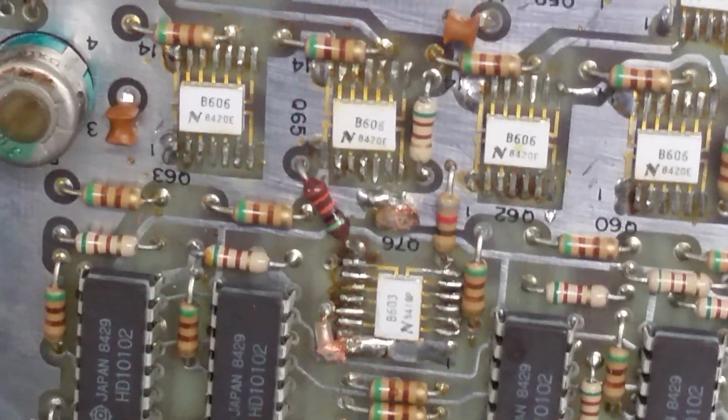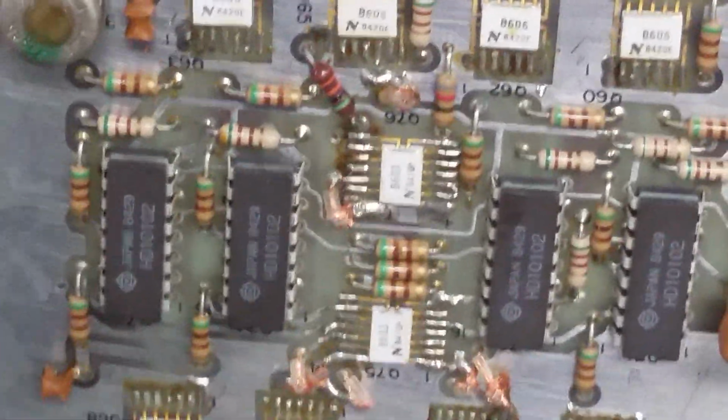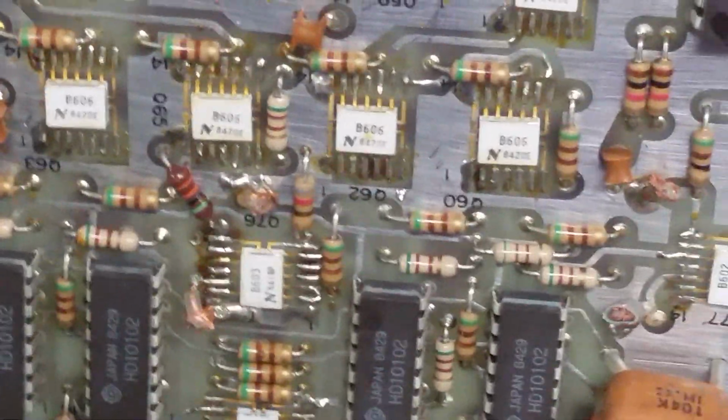They have the logo. They certainly kind of have the ECL vibe, being near some other ECL, and there's an awful lot of termination resistors kicking around, which also kind of screams ECL, because with ECL you have to treat everything like a transmission line. Everything gets a termination resistor. That's just the way you had to do it.